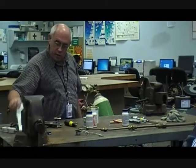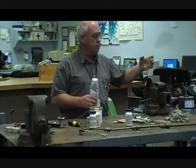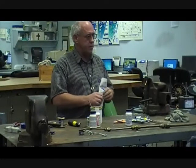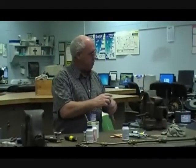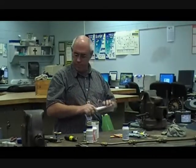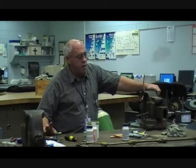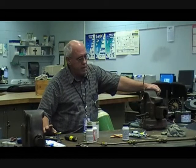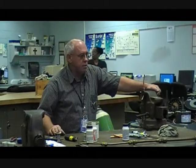While I've got it in my hands — what if I've got a situation where I have a component that cannot stand the heat? Well, I need to protect it. This is a heat block — it's a paste that would go on the pipe. If we put it around the pipe, it helps to prevent that heat from being transmitted through conduction. But that doesn't always suffice in itself. It's good to have a wet rag or something of that nature close by, or in many cases you may have to disassemble the part while installing.